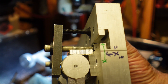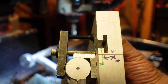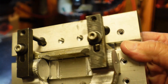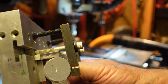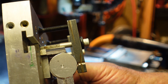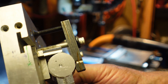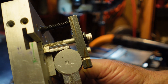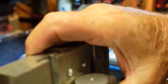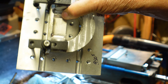Just center drilled it — doing it for kind of yucks to see what I'd end up with, and this guy came pretty good on center just eyeballing it, looks good. But when I turned it around in the lathe chuck and did it again it was basically off-center. It looks like it was spinning fine but it looks off-center to the casting, so I think I'm going to go ahead and set it in the mill vertically and come down on the good hole that I see — that's my plan.